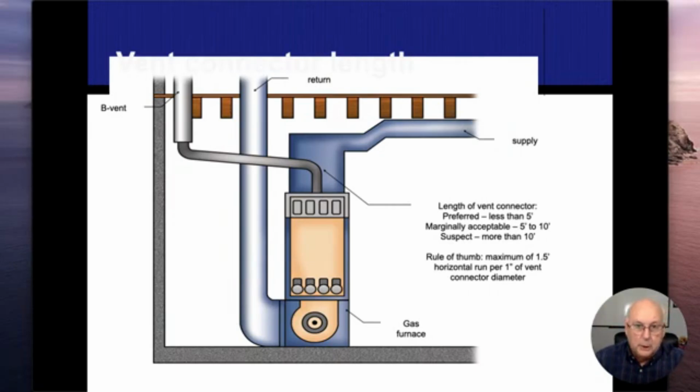And the person who's going to install the water heater said that it goes into the flue. And I'm like, well, that's not possible. People just don't do that. It was the case. So what I ended up doing was disconnecting the water heater vent connector where it went into the chimney. I ended up putting a flashlight in there. I went into the firebox and looked up the smoke chamber and looked up the flue, and sure enough, there was my beam right there for my flashlight. It was definitely coming right inside there.